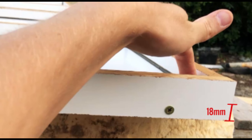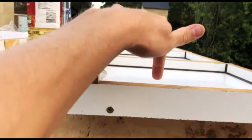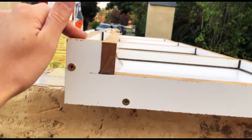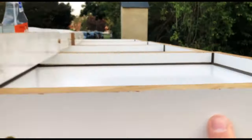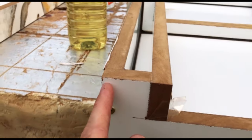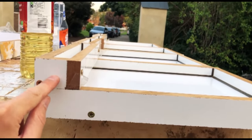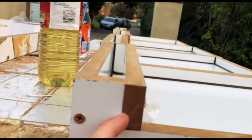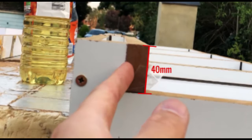On the opposite side we have 18 millimeters for the base melamine board plus 25 millimeters for the concrete thickness, which is a total of 43 millimeters. Along the side pieces we have L-shaped pieces: the thickest part of the L is 83mm, the lowest part is 43mm, and the amount it comes out from the front lip edge is 43mm, because you need that 25mm thickness. There's also a piece of shuttering across between those two points that's exactly 40 millimeters — that's the drop of the front lip edge.